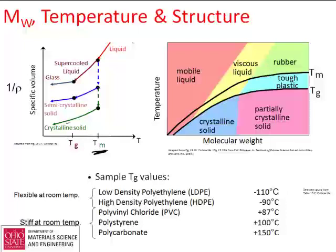The other thing that can happen is if you've got something like glass, you're cooling down, you hit the melting point, it may not be able to solidify for reasons that the chains get in their own way and they can't form that solid structure, which is usually crystalline. So as a result of that, you cool down, the viscosity increases, and eventually it kind of squeezes out what's called the free volume, and your apparent thermal expansion coefficient changes, and you hit what's called a glass transition, and then the material becomes fairly glassy at that point. So polymers and glasses are things that have hard times solidifying. You hit the melting temperature, but they may not be able to solidify, so they have this amorphous, disordered structure that gets locked in and can become glassy.